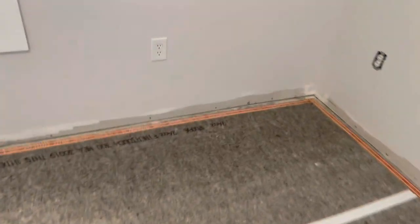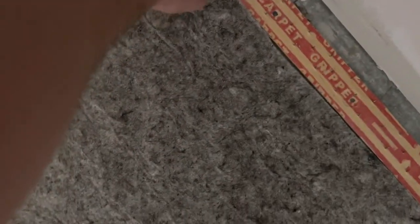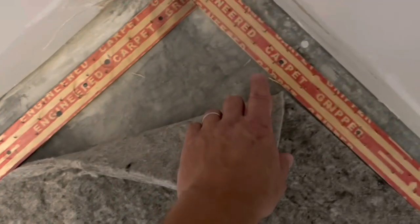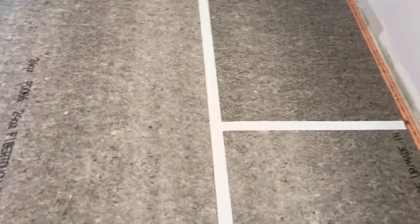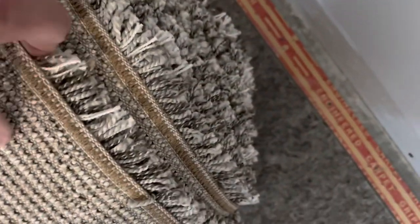While it's not secured everywhere, it is secured almost everywhere. You can see there's about a foot gap in between. So I've got it secured enough where it's not going to be moving while we stretch the carpet. When I get that other big piece in here — you can kind of see what we've got going on — woven, got the big ribs on the back, woven shag. We are using the inch-and-a-half architectural tack strip.